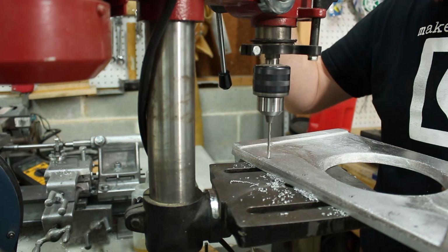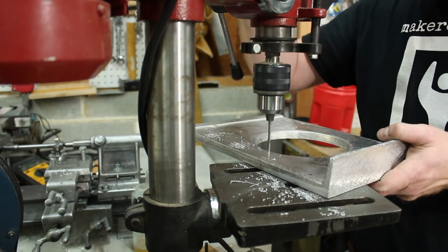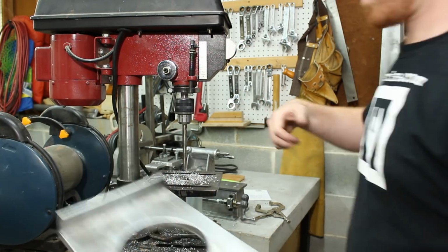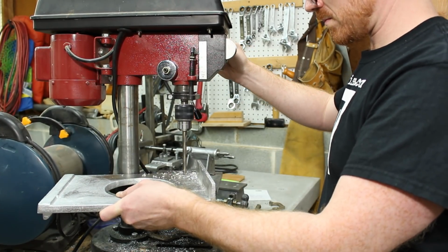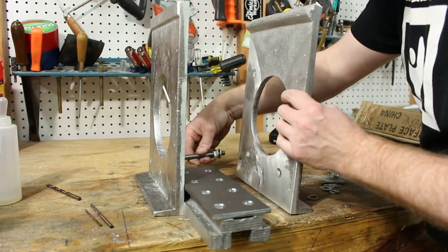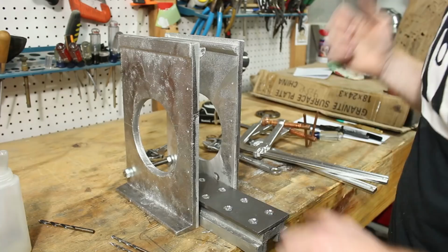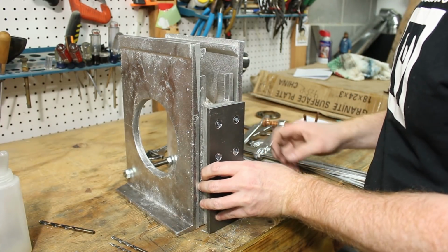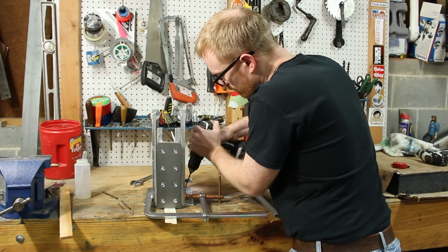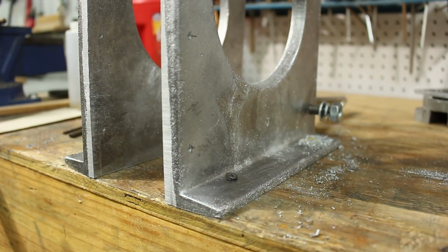I drill pilot holes into the column side castings, and all of these won't have fasteners installed, at least not initially. I also drilled a hole in the rear bottom for the rear lower spreader. That's a section of M10 by 1.5 millimeter threaded rod. And I use some nuts on either side to kind of fixture the rear of the column together while I clamped in the column front. I secured the column sides to the workbench temporarily while I was working on it.